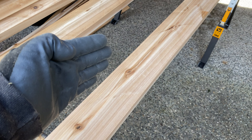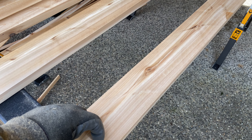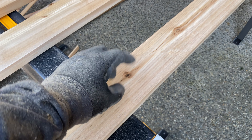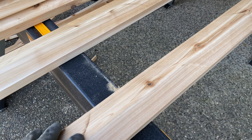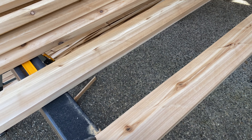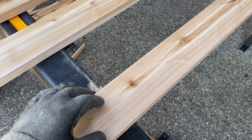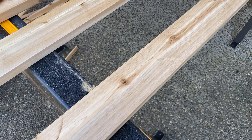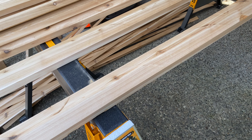There will be a width — the thickness of the channel that holds the hog wire — and at the end of that, I'm thinking of flattening this out the width of a vertical, so that this can stay sloped for shedding rain. But where the vertical comes up the side, it'll be sitting on flat. That's a lot easier than trying to cut this angle to match on a vertical, which would be a tough cut.